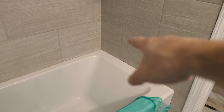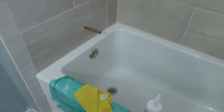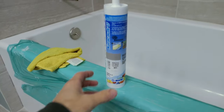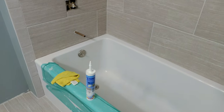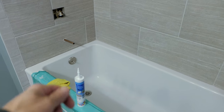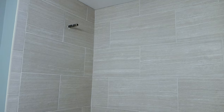That's all finished up with the shower area. We'll come back when the grout is dry, wipe off the haze, and then caulk the areas we talked about earlier. It's been about 24 hours since I grouted, and all I've done so far is use a damp microfiber rag to wipe down any haze that's left — you can use any cotton rag, it's not that critical. I'm going to use a color-match caulk. You can either use a pure silicone caulk — white or clear — or in this case a color-matched caulk matched to the grout color. To make a nice clean edge, I'll use blue painters tape to mark the edges, caulk, then peel the tape off for a nice clean line. That's really all that's left — that's how you grout a vertical surface like a shower wall. The same idea applies to a backsplash in the kitchen or any other vertical surface.